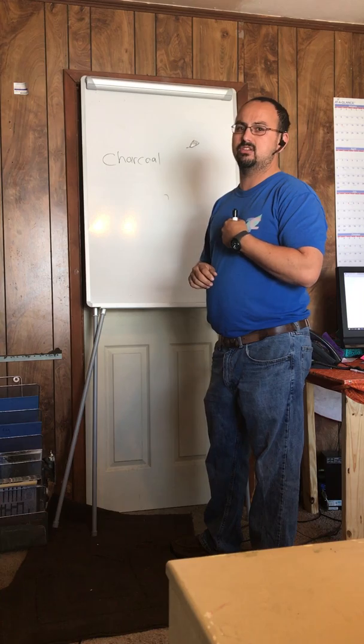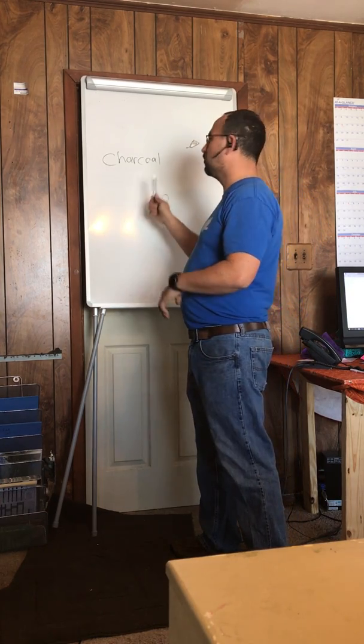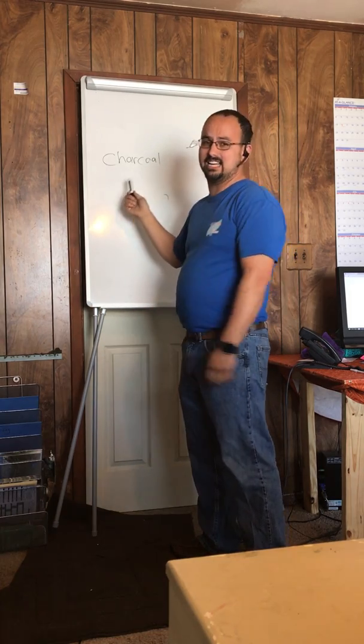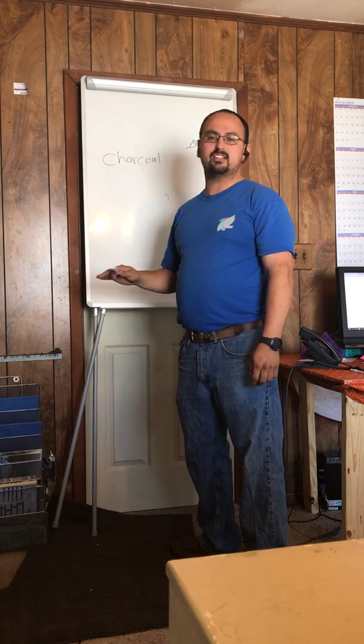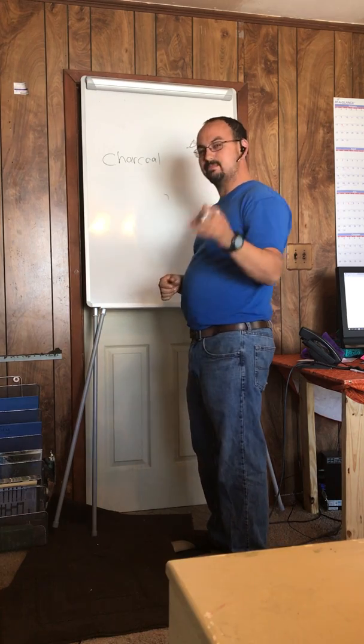I'm still going to tell you that if you're a normal American, living a normal American life, a 1-inch filter is going to have to be changed once a month. I don't care what you paid for it, and I don't care what it's got in it. Done deal. Sorry what you thought. Get over it. You can hate me later. That's fine. A couple other things to keep in mind.